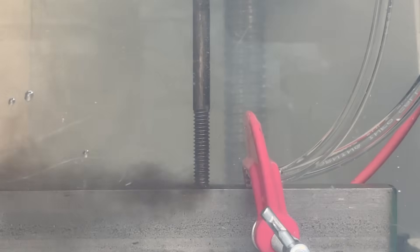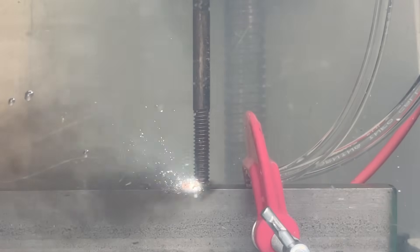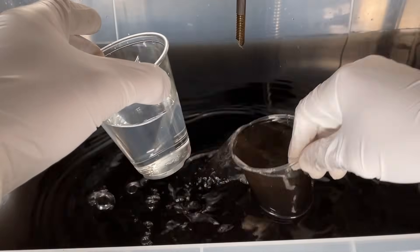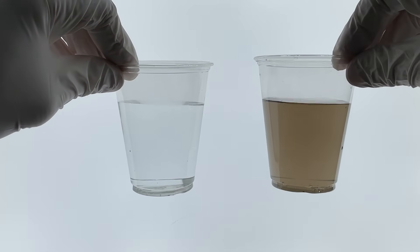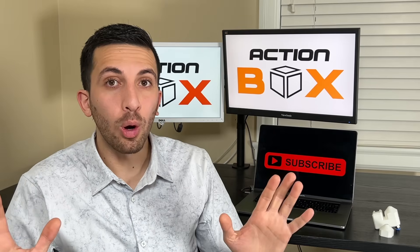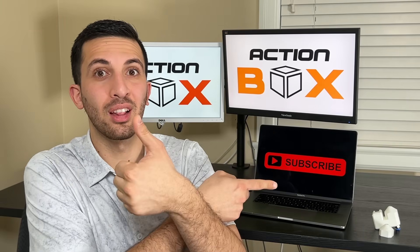We wanted to know whether our current just consumes the wire too aggressively, and after making some sparks we noticed that the wire gets consumed far too fast. So we decided to remove our wire contraption from the CNC machine and use a thicker piece of brass for comparison — we loaded it into our CNC spindle and lowered it at a rate of one millimeter per minute. Note that we have the water pump flushing away the swarf, which is the black residue. I'm reaching out to you all to ask what's wrong with our wire EDM contraption — let us know and we will build a second version with your commonly suggested answers. As time went by the deionized water got really dark and we stopped the experiment. I've now learned the water has to be filtered if we're to build a proper EDM machine. You learn by failing — subscribe and like please!